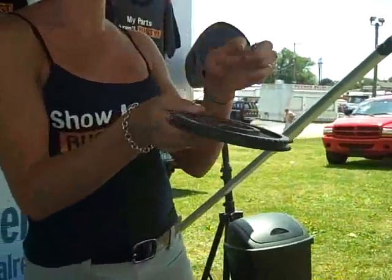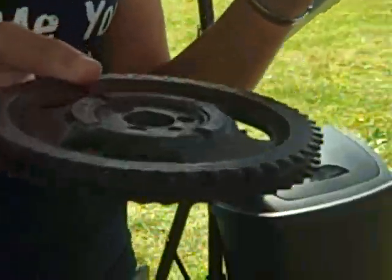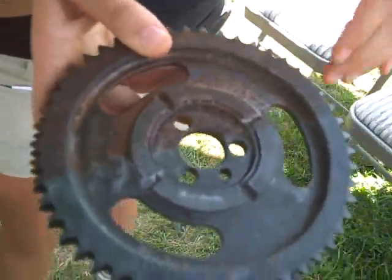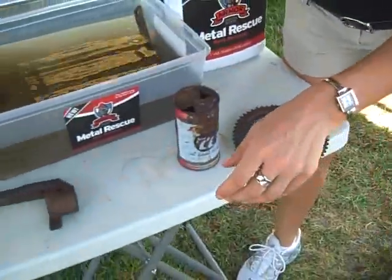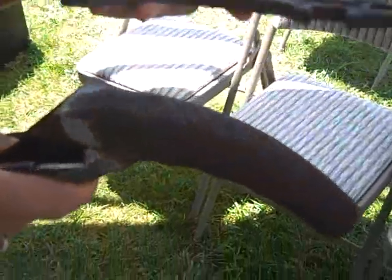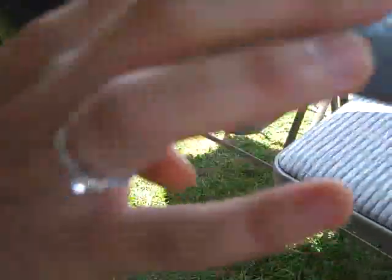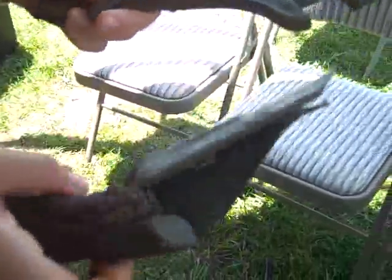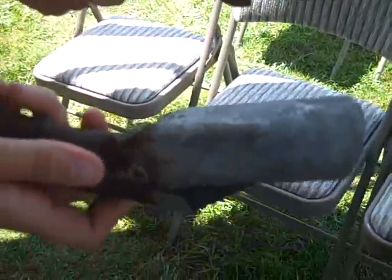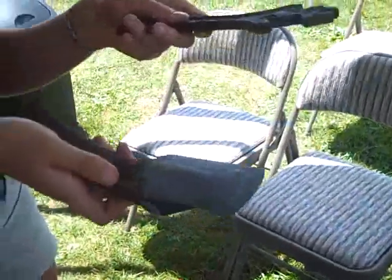As you can see here, the soaking time on this was 30 minutes. Soaking time sometimes depends on the type of metal and also the rust content. To give you an example of the difference: these two items here have pretty much the same rust content, but this one was a 24-hour soak and this one was a 6-hour soak. This metal is more porous, and this is more of a plate metal, so that's why this took less time than this did.